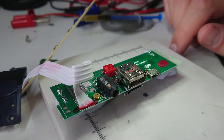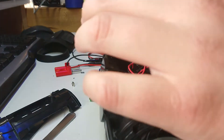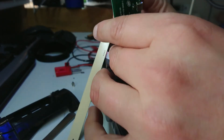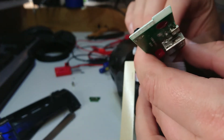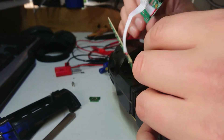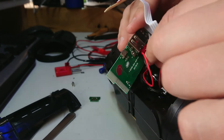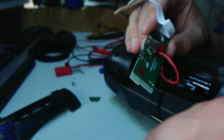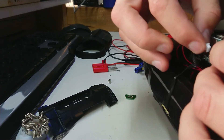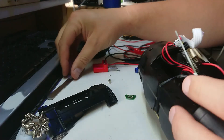Let's turn off the microscope, plug everything back in with batteries and a lead, and see what happens. This is where marking the sockets is handy — I would have plugged them in backwards had I not marked them. The battery connections go back in. Oh — those are left and right speakers, so they must have passive crossovers in each side. Let me use a spudger to plug that socket in since I can't get my fingers into it.